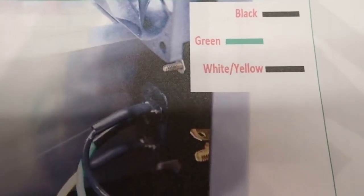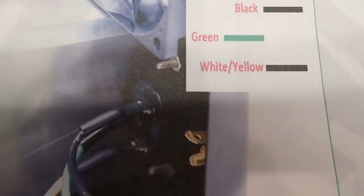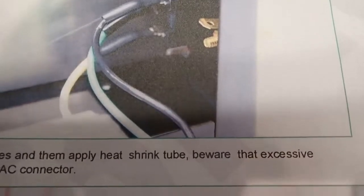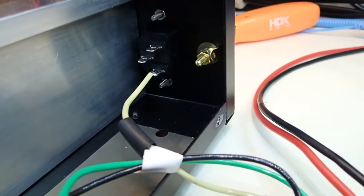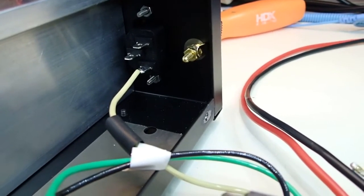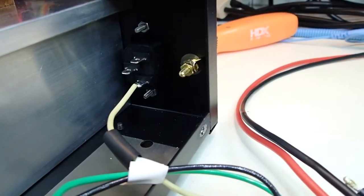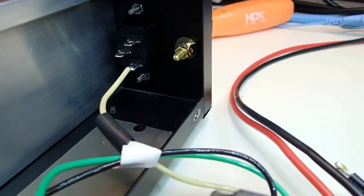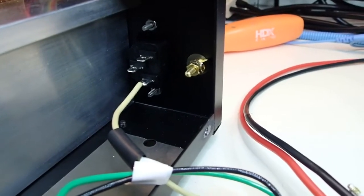The next step is to install the power socket on the rear of the chassis. The wires are black, green, white, and yellow, each with a piece of heat shrink. The yellow wire is soldered in — you have to solder very quickly so you don't melt the socket. I put a small heat sink on the back of the terminal and blew it down to cool it off as quickly as possible after soldering. The next step is to put the heat shrink on and move on to the metal terminal.